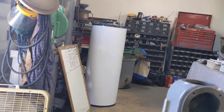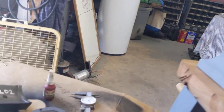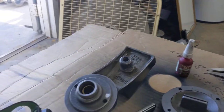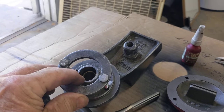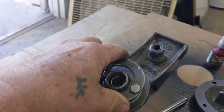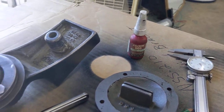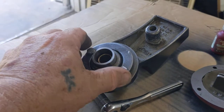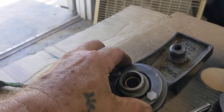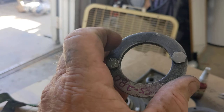Mine's got the air pump. The white dot goes to the left side over to the drive unit. I've already had Loctite set in these — use the 609 Loctite. The green is stubborn-mule Loctite. I could have silver soldered, I could have put a TIG weld on this, I could have rebuilt this whole washer, or I could have come over here and drilled and tapped new quarter-20s.